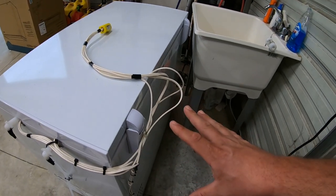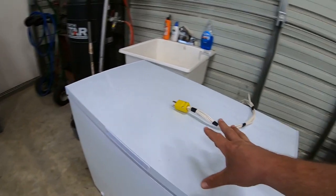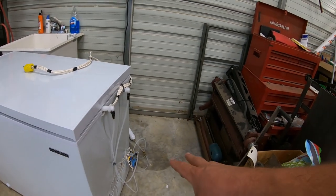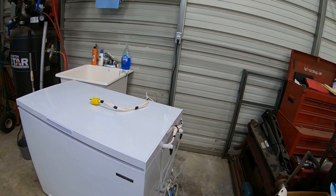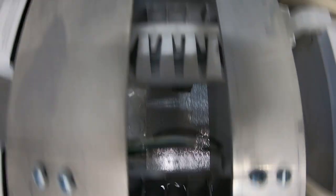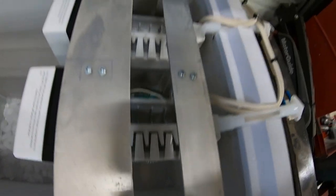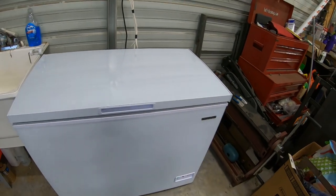I secured some wiring — still a lot of work to do. The freezer has been running for quite a while and it's back down to zero. If the ice makers are cold enough, as soon as I plug this in, water should come up through both tubes. I can check for leaks and we're gonna let this run for quite a while to see what we're getting out of both ice makers. I had to step away for a minute — they didn't immediately kick on, but there is water down in the ice maker now. Both of them kicked on and put water in there, so we're gonna let this thing run and see what it will produce.